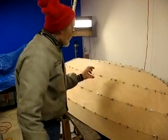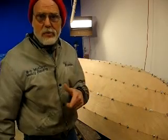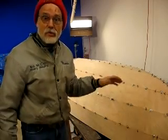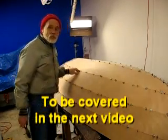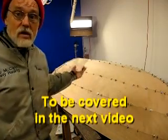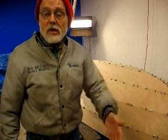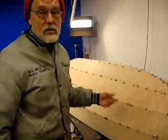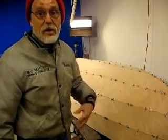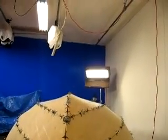The hull is all set up. Before I add the tape, I'm going to take some pictures, and then I'm going to put masking tape on the spots where I have some gaps — right in here is a little more gap than I'd like. I'll cover that with tape on the outside, so when I flip it over and pre-wet the edges on the inside before the jump stitching, any epoxy that oozes through isn't going to create a big puddle and cause a scraping and sanding problem later. A couple dollars' worth of masking tape pays well in saved labor.